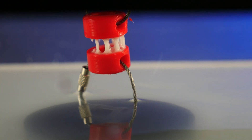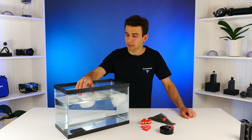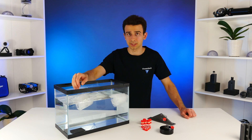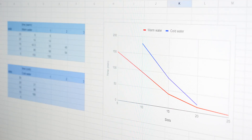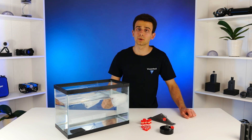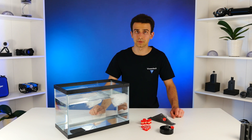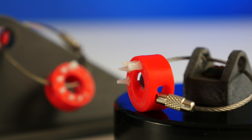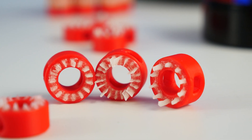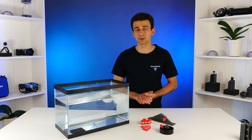I've conducted a number of different tests with these releases and so far I'm pretty happy with the way they're turning out. I tried them in still water, in moving water with the aquarium pump, and finally in cold water — since the depths we would be going to have near-freezing water, I filled the aquarium up with ice to see how that changes the dissolving rate, and it is a pretty big effect. One more thing I certainly need to do is a saltwater test. I don't anticipate that the salt content of the water will greatly impact the dissolving rate of the BVOH material, but that's definitely something we need to find out. I'm really happy with how it's turning out — I think this is the solution I'm going to use for the next field test. It's way easier than the salt releases and super customizable, so I can tailor it exactly for our needs.